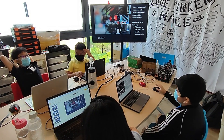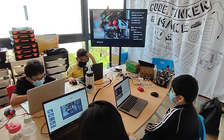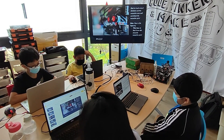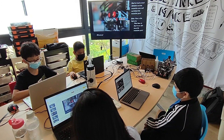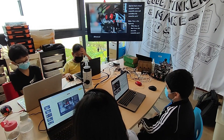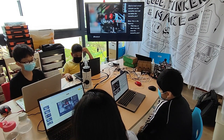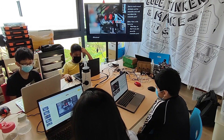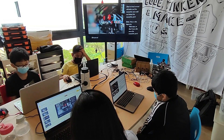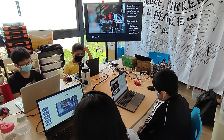We will now talk about the ultrasound sensor. The ultrasound sensor is placed at the side of the robot and is used to track around the obstacles on the map and also to track the walls in the evacuation zone and detect the evacuation point. Since we do not know the size of the object on the line, we keep a fixed distance from the object and continue moving until the robot sees the line again. We use the same code to track the walls of the evacuation zone. At first, we thought that if the ultrasound sensor reading was below 15cm, it would sense the object. But since we also needed to detect the evacuation point, we tilted it down to sense the evacuation point, which is 6cm tall.